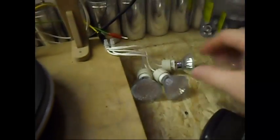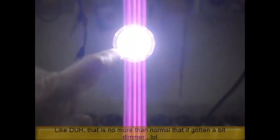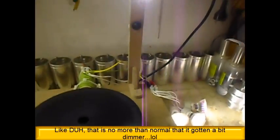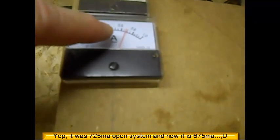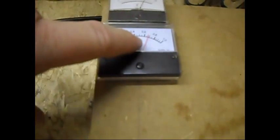Now I'm going to put the other 3 one-watt loads on it, so in total 4 watt load. Here it goes. As you can see, this one got a little bit dimmer because it's pulling more for all 4 now. I can hear it sped up already. The amp draw is now below 700 - it was 725, it is now like 675, so basically 50 milliamps less.